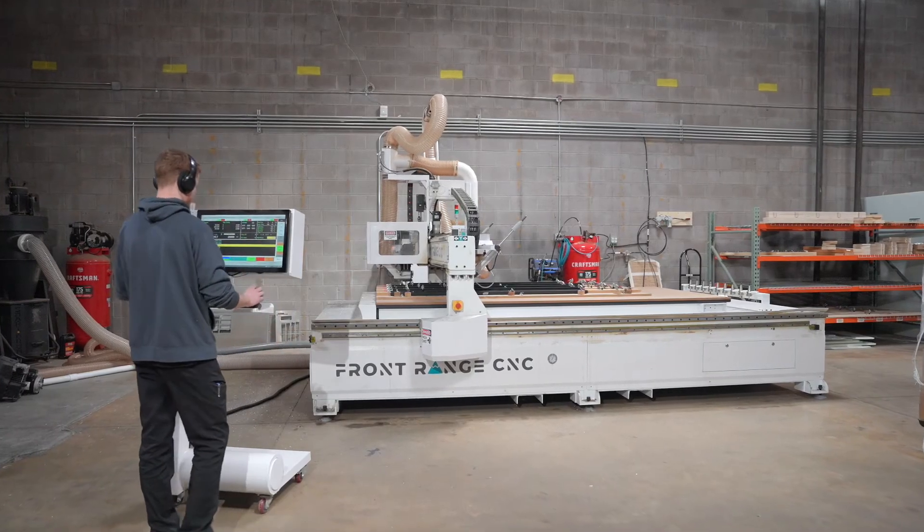There's bidirectional lead screw compensation, which is just a really fancy way of saying that you can laser the machine in both directions and take out any kind of physical impurities of that machine. This should be done on really any machine that's $60,000, $70,000 and up. For us, it's one of those things where we want to make sure that the base of the machines is as capable as possible so that we can accept these additions through the controller itself.